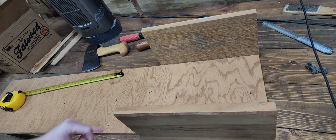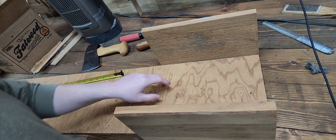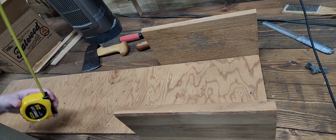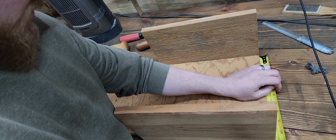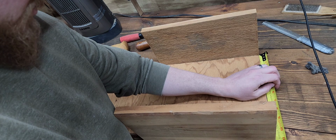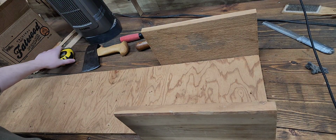That wouldn't be bad. I kind of like the industrial look of exposed screws too, so maybe I'll drop the sides down on here and just do a nice countersink screw in there, and I'll do the outside with whatever I come up with next. And I also have the table saw set at this same dimension, so cutting a piece of this would be pretty easy. I'm liking this even more. And that would give me an internal dimension of 10.5. That'll be nice. Okay, I made up my mind.